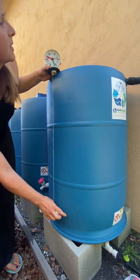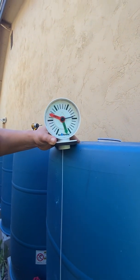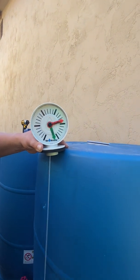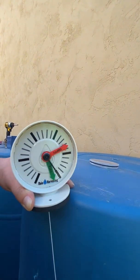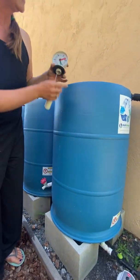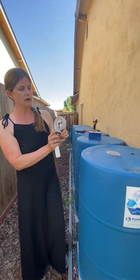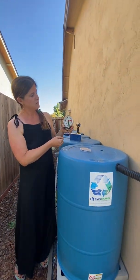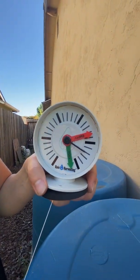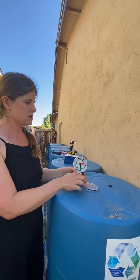I'm looking at the little black part of the dial. For empty, I'm just going to use my finger to move the empty marker around there. People ask why we aren't using the whole 360 degrees — that's because this piece actually works with tanks up to 100 inches tall. The numberless dial is a really flexible way to do this. So I can see with the dials that I'm half full, close to full there, and nearly empty there. This has been a really effective way to measure.